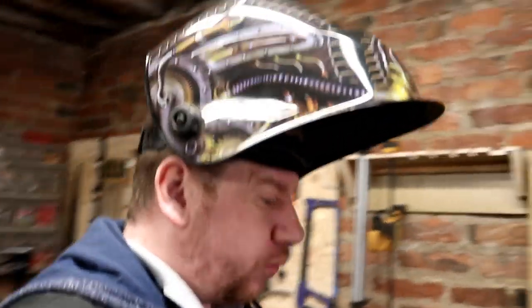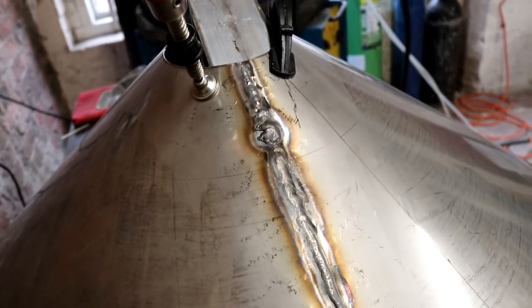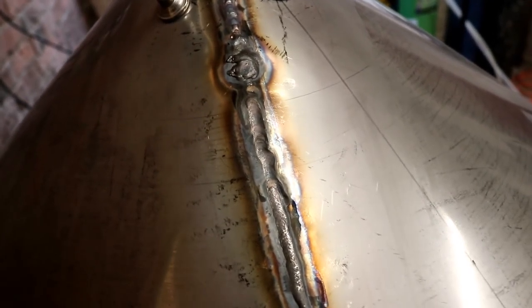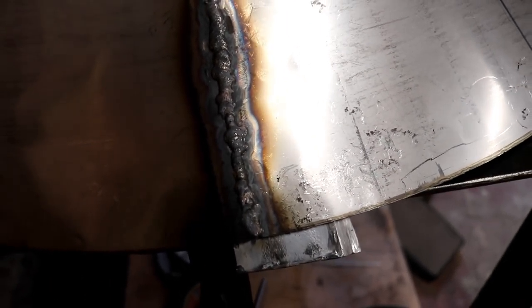Feel like I had a real good impact on this particular conical weld. If we take a look, you can see that we started to run and found the first big gap there, which obviously blew out, but I managed to patch up. But the run looks pretty good. And then we were washing the base metal in, so the weld looks a bit low there, and I started adding rod, and it comes back up until we hit another small blowout. These are all bad fit up areas, and I've just put some more weld metal in there until we get to the bottom where it slightly starts to distort.